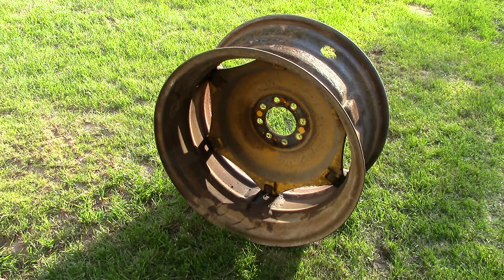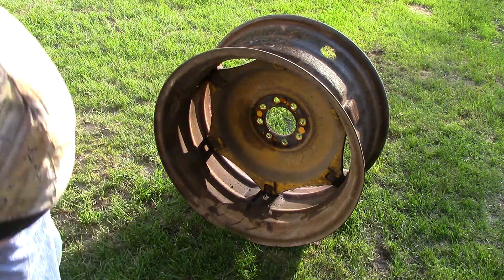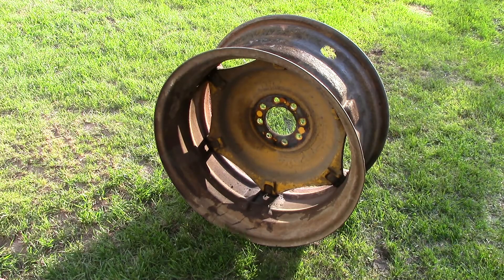First you've got to get back far enough so that you know there's good metal there and cut it out, then replace it with new metal. Before I get into the repair section, I need to work on this wheel because there is so much rust on it. I need to remove the scale and rust that's on the inside of the wheel all the way around, and I will do that with a needle gun. So that'll be the first thing I do — I'll start with the needle gun right now. That's going to be a little noisy, and we'll get this wheel all cleaned up.